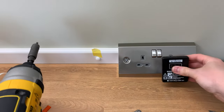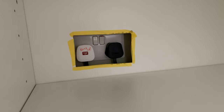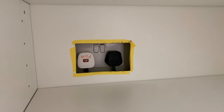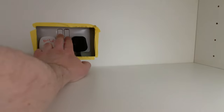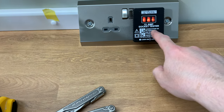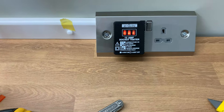I've just connected this back up, so hopefully give it the old tester and that should be working. Except it's not, because I haven't turned it on under here. So in this cupboard down here - don't mind the tape around the edge, the jigsaw made a bit of a ragged finish so I was just taping it to stop it getting any worse - I've got access to both of the fly leads for those plugs. They're basically just extension leads, not fixed wiring, but if I ever needed to replace the fuse or isolate one off, I could do that. If I just flick that one on now, that should light the other one up. And there we go. These socket testers are very useful - basically if you get three lights it says correct. Any other combination means there's basically something wrong. Very useful to give yourself the okay when you've done any socket work.